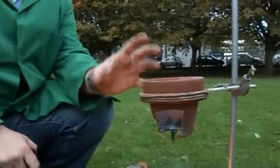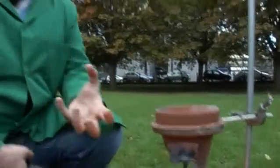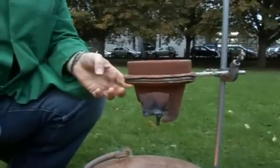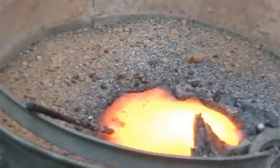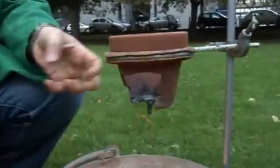As soon as the sparkler hit the top of the thermite mixture, it started off the instantaneous redox reaction — this was where the metals were fighting for the oxygen. The aluminium won that battle and came out as aluminium oxide. The iron was reduced, and we can see that now in the bottom, which is really hot. The iron was molten and it smashed its way out through the bottom of the flower pot, and it's now cooling.